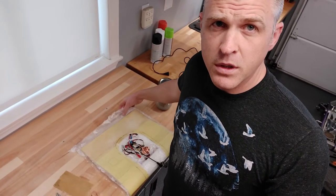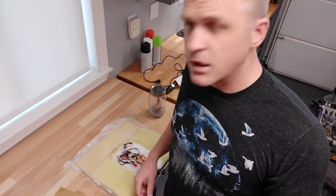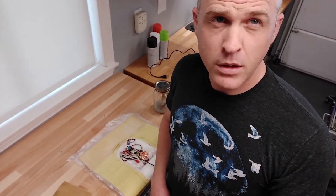The final step is to get rid of any excess fiberglass by cleaning it up with 120-grit sandpaper — and at that point you're done. One thing I forgot to mention: fiberglass is sandable, whereas Kevlar is not. So if you have any surface imperfections you want to smooth out, you can do that with the fiberglass on top, but you can't really do that without it. That's another benefit beyond just giving it a smoother finish in general.